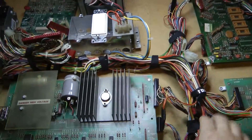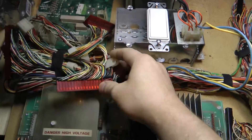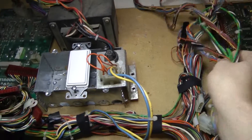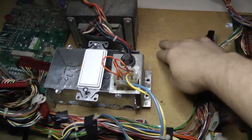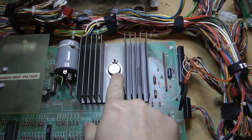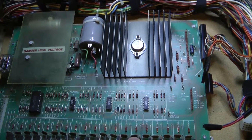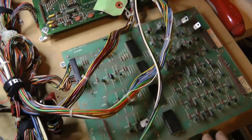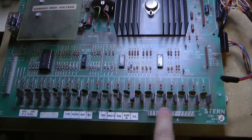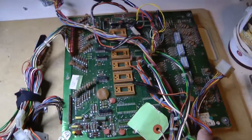Now I'm midway through the build. I've got the harness basically connected down and the boards are all in place. The harness ended up being a little bit bulkier than what I was expecting, so this is the display harness here and the rest of the harness is going to have to fold up into this area over here. I've also left a little bit of space — I was thinking I'd just put in some cheap multimeters from eBay, dedicated really cheap little meters for the regulated voltages, the plus 5 and the display voltage. That'll make things easier — I can just drop in the solenoid driver and voltage regulator board and see the voltages right off hand. For the lamp driver board I've got LED boards which I'm going to install. For the solenoids, at some point I'll wire in some LEDs to each of the solenoid outputs.